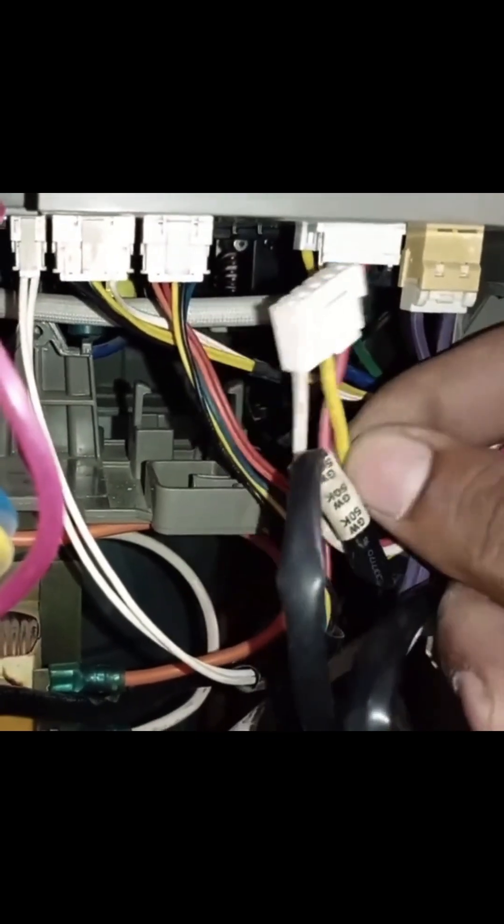In addition, let me show you where the connector is located on the PCB. This connector is for the outdoor unit's DC fan motor. I've removed this connector, and it is installed here. If this connector becomes loose or disconnects for any reason, the L3 error code will show on your display. You can simply reinstall it to fix the problem. Sometimes, due to the unit's vibration, some connectors become loose, causing them to lose contact with each other.